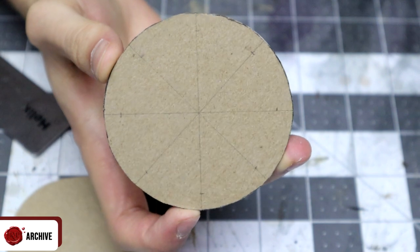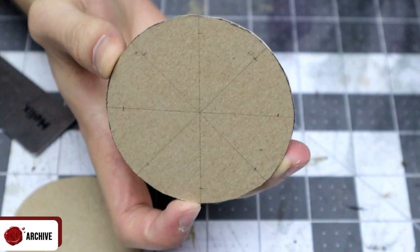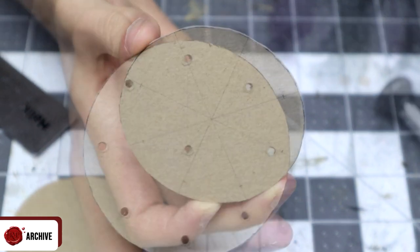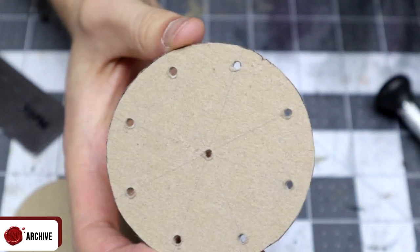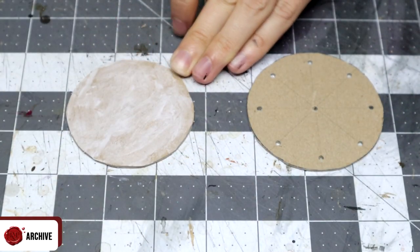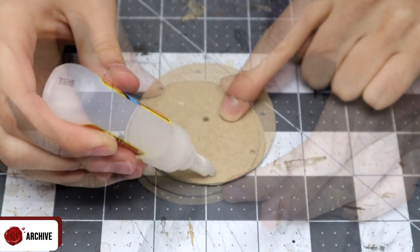The inner piece was a 3-inch diameter circle, which I drilled 3mm holes into at the center for the skewer, and some more 3mm holes 1/4 inch from the edges in 8 opposing places for the magnets, though I installed those later. I then added a 2 7/8 inch circle to the inner piece, building outwards away from where I was going to connect it to the crane.